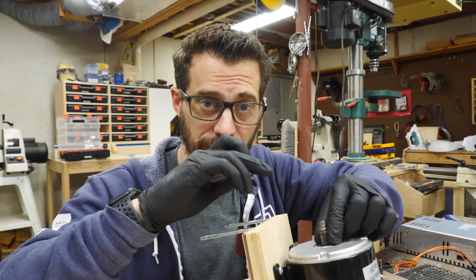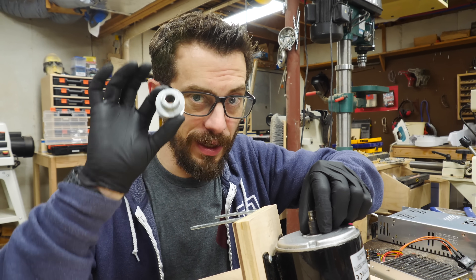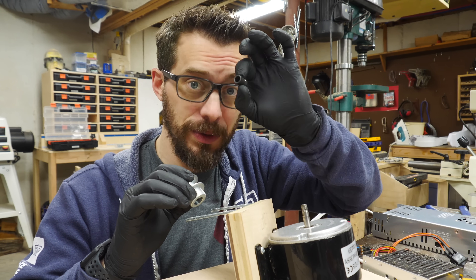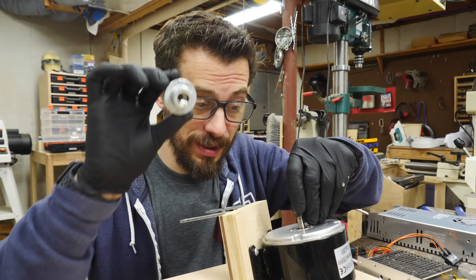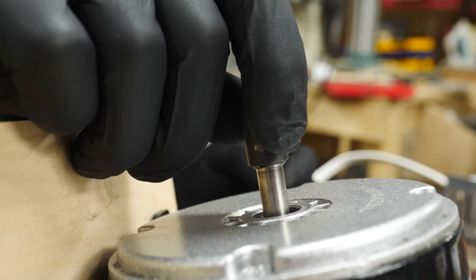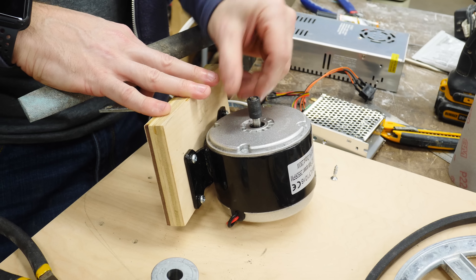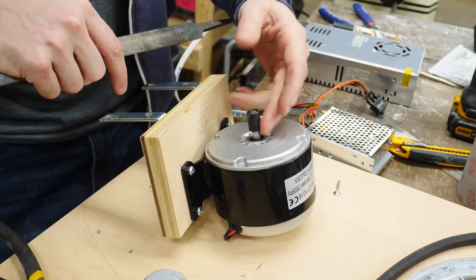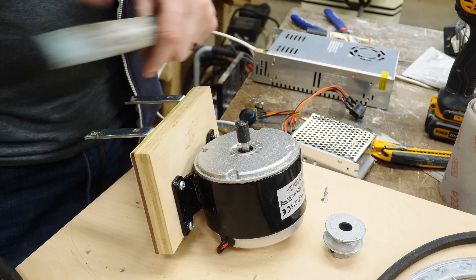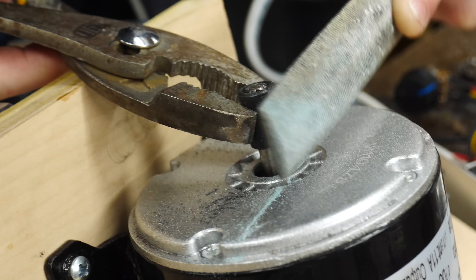To get this pulley installed on the shaft of the motor, I measured the outside of the shaft, and then after I ordered the pulley, realized that this is actually a sleeve that's not attached. So we're gonna have to attach this so that we can attach the pulley. We're gonna use some two-part epoxy, mix it up, put this piece on the shaft, and then grind on a flat so we can attach the pulley. The epoxy's all dry now and in place, but I need a flat surface for the set screw to sit against, so I'm gonna hold this shaft and use a file to gently file in a small flat spot.